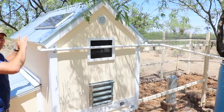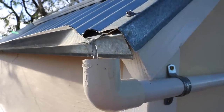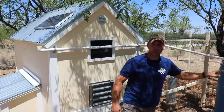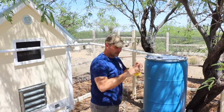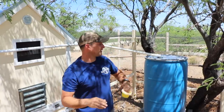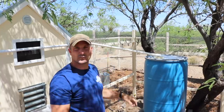Now for the rainwater harvesting system — I live off of rainwater so I don't like to let any of it go to waste. For the coop, the harvesting system starts at my little makeshift gutters, which I made out of corner flashing. They don't have super high capacity but they work fine. Water comes off the roof into a PVC elbow, runs to the other side which is the exact same setup, and then down to a blue rain barrel. I don't have any filters or screens on those inlets because I have them over here on the barrel — a little insert cup with a metal screen. Whenever it fills up I just dump it out, and that keeps the water pretty clean inside the barrel.